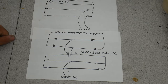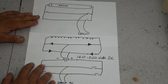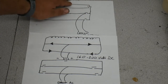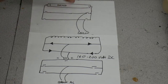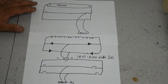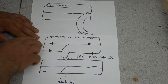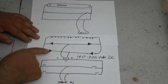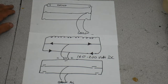It's like this. Now you'll notice that these are quite similar in that we've got the same set of MOSFETs with a 24 volt input. Of course, this could be 12 or whatever. Now the same switching set of MOSFETs energize a transformer. This transformer then energizes the secondary windings, goes to a set of diodes, rectifies this back to DC, and then this same thing starts over. Now let's back up and make more sense out of this.